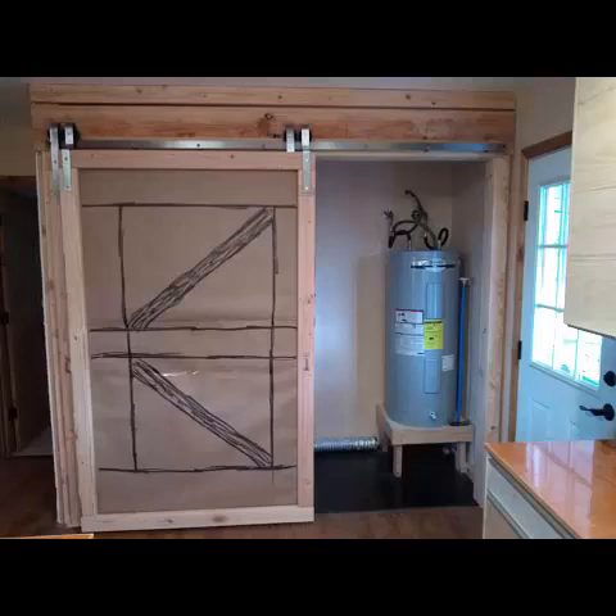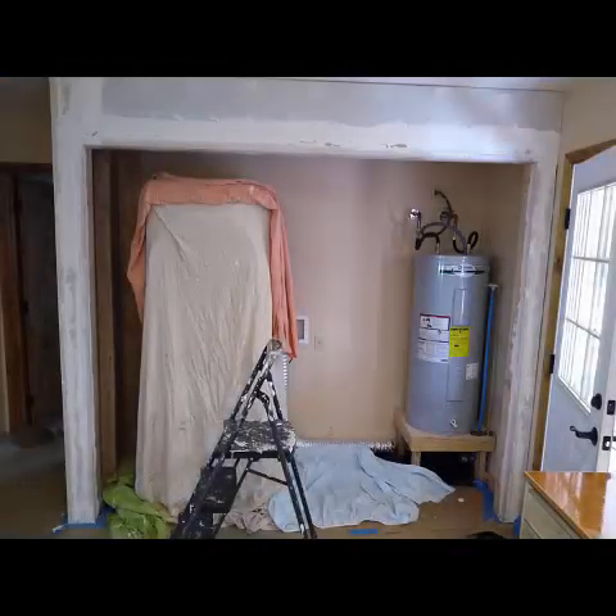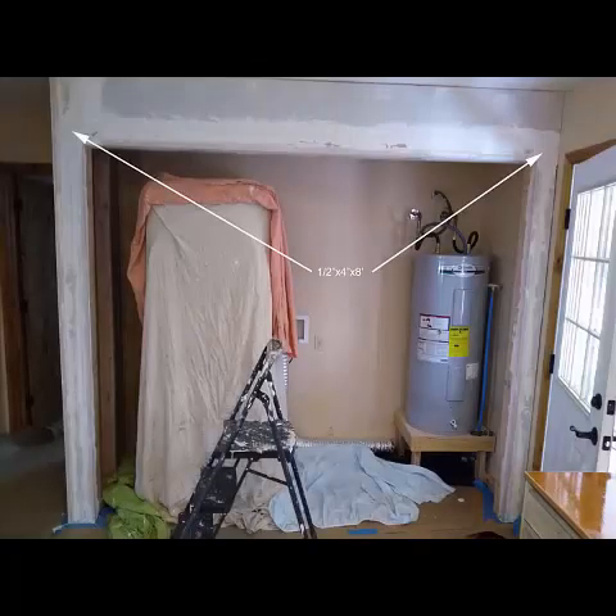While completely unnecessary, we marked up the 2 doors out of 2x4s and placed them on the rail to check the closet openings. The opening was then drywalled with half inch drywall, and the 1 by 4 by 8 foot board was taped and textured as well. Be sure to mark the holes for the rails when drywalling so they don't disappear — golf tees work well.